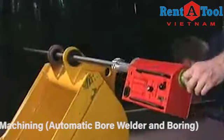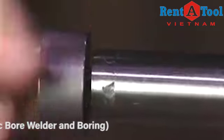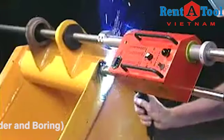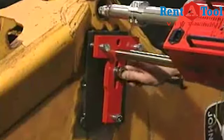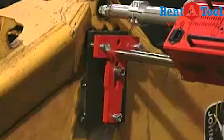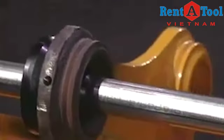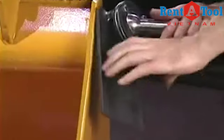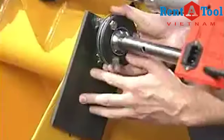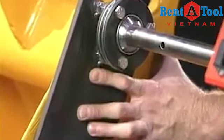Depending on your application, the BOA can be mounted to the workpiece using the supplied tack nut and may be centered with a boring bar or any 1 1/4 pipe. The optional T-base provides adjustment for manually achieving parallelism and concentricity. When 2 or more inline bores are to be repaired, a centering cone and rod set can be used for easy alignment. The optional ball mount allows for infinite adjustment of the tack plate. Very handy when the mounting surface is not exactly perpendicular to the bore hole.